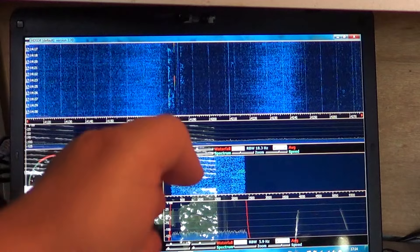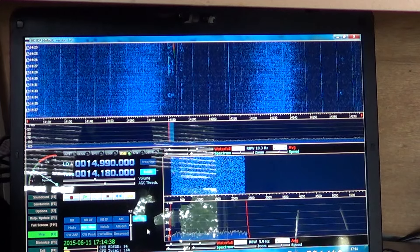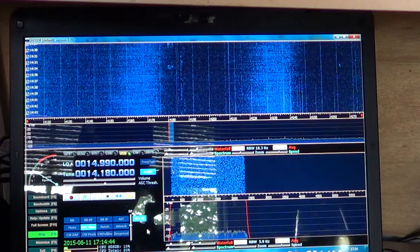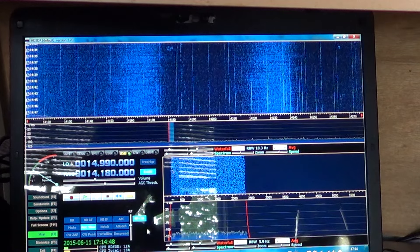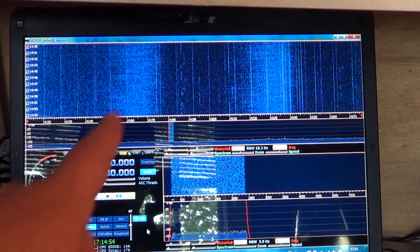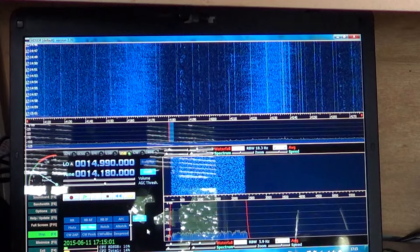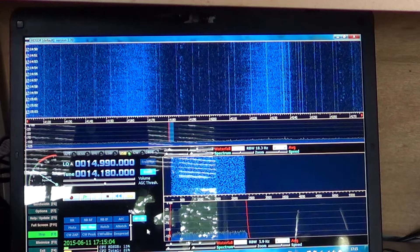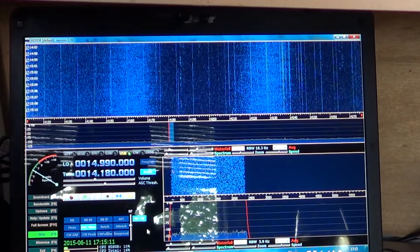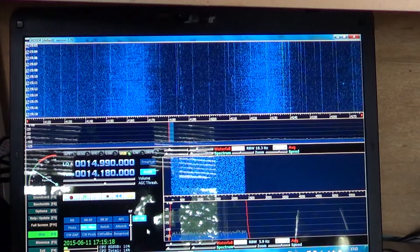On the top there you see that there are vertical lines. From what I see, the vertical lines are the type of noise that I actually pick up with the antenna, and not the computer's noise. Because when I plug back my ICOM ICR 8500 and shut down the computers, every little line that you see there, my 8500 has a little spike of noise. It's part of my general noise. So the vertical lines you see at regular intervals seem to be noise coming from my neighbors — some kind of digital hash that is full of harmonics, and that's why you see the lines.